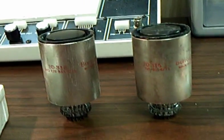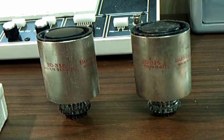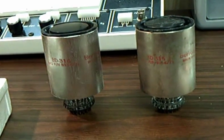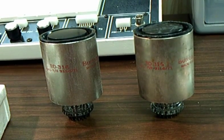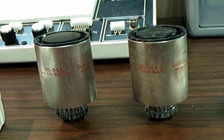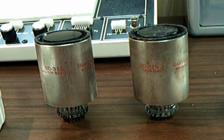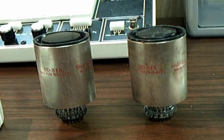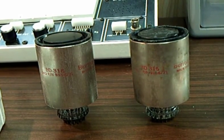Right here we have the BD316 and BD316-1. These are a slightly later beam switching tube. They still have an external magnet and are still basically constructed the exact same way. The only difference is that they have a more compact, slender glass envelope, which means that the entire diameter of the tube comes down — the magnet is a smaller diameter and the shield is a smaller diameter.